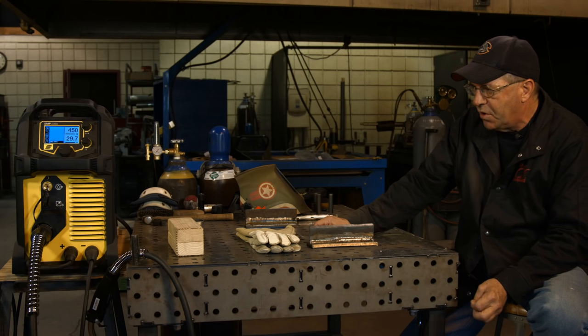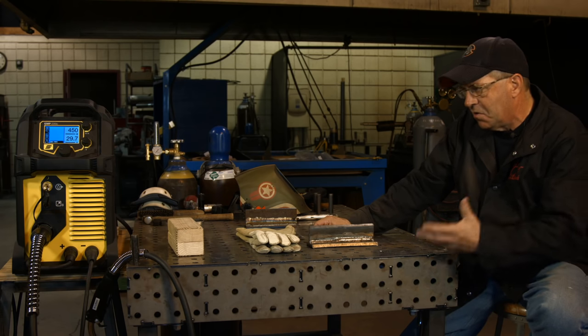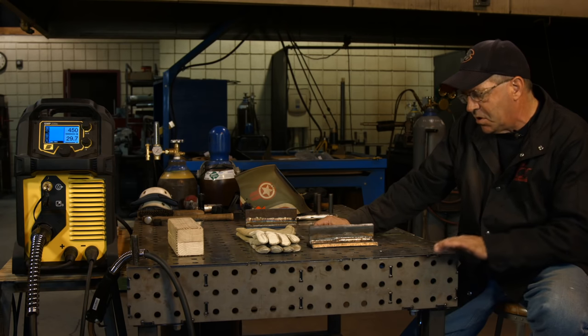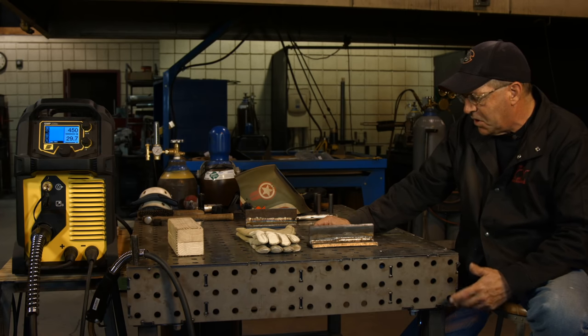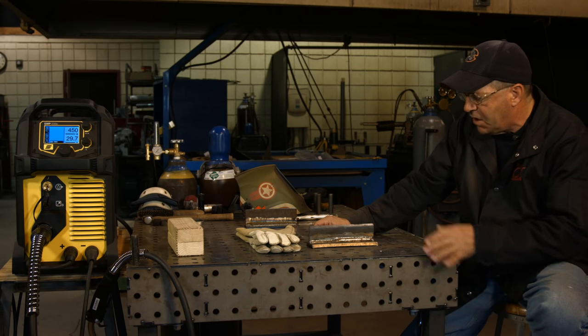The machine goes to 30 volts and 700 inches a minute on wire feed speed. I don't want to run 700 inches a minute — it's too high for a .045 wire to get the right combination of voltage and amperage and arc length and get the right spray. But we could have gone up a little bit. I know some people run a little hotter — I like to run hotter, depends on the weld we're doing, but we've got to guard against undercut and get our bead profile blended together.